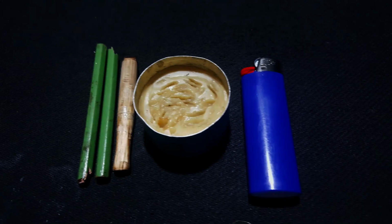This is an optional step. Dopping is a process where we stick a stone to a little wooden post just to make it a little bit easier to handle. You just stick it with some sealing wax, but we'll go through the process. I'll demonstrate shortly.